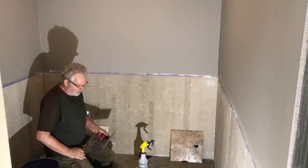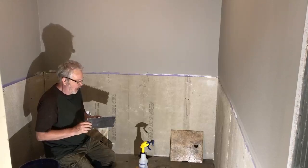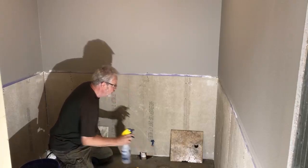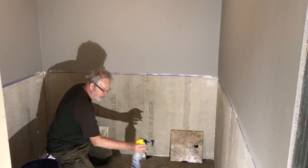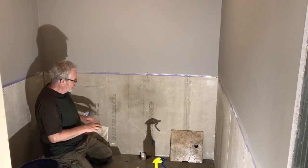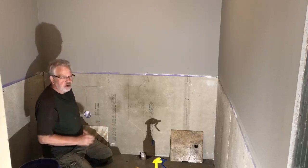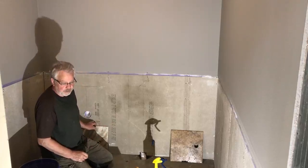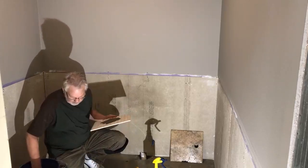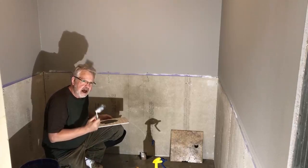We're ready to start laying our tile. I'm doing a 12 by 12 tile so I'm going to be using a trowel that's quarter inch wide and quarter inch deep. There are two ways to do this: number one is put the mud on the trowel and put it across the wall — if you do that, I strongly suggest spraying down the hardy backer with a spray bottle so the thinset doesn't dry too quickly. In my case with some obstacles and shimming to work around, I'm going to use back buttering instead — simply take the thinset and put it on the rear of the tile, spread it, and it's ready to go.